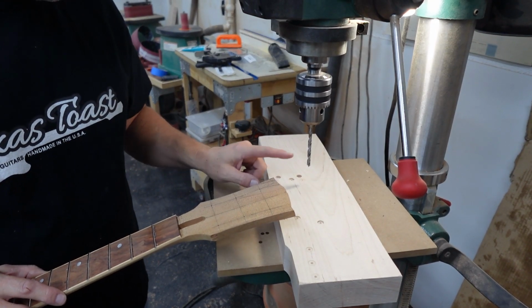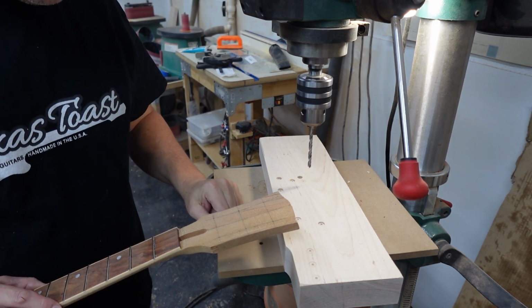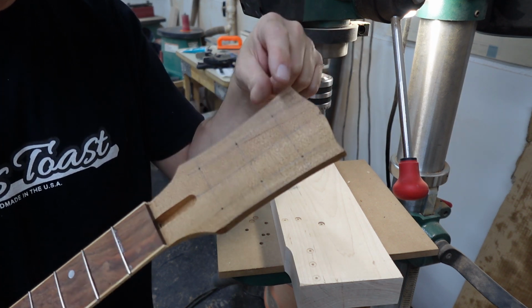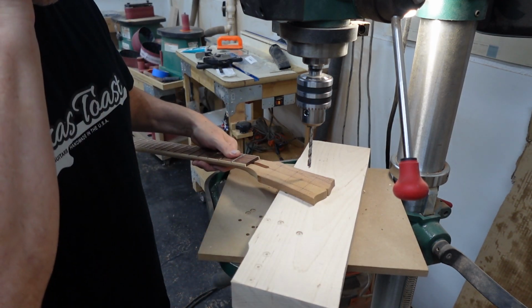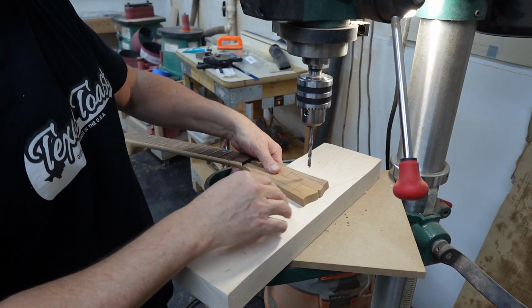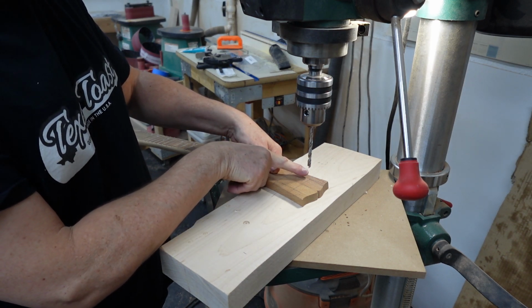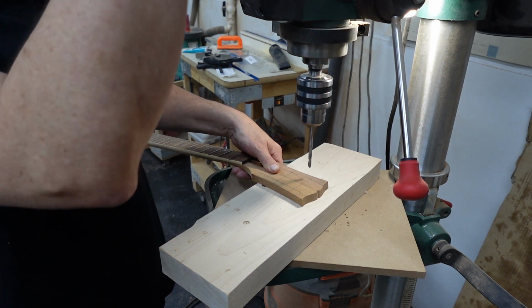Okay, in my drill press, I have a 1/4-inch drill bit, and it's running pretty true. It's a brad point, so it's going to match up with the holes that I have marked and used a scratch awl to indicate where the brad point's going to go. If you've ever been to a workshop, you know that Chris calls a scratch awl a sticky pokey. But anyway, what that's going to do is it's going to give the brad point of the drill bit a place to aim, right?